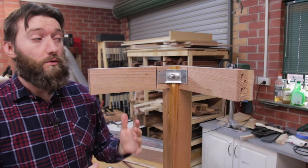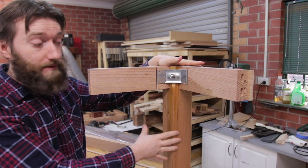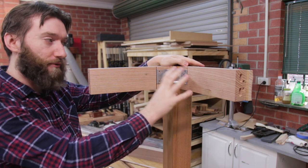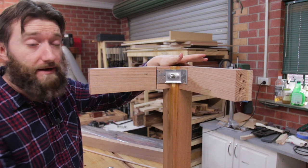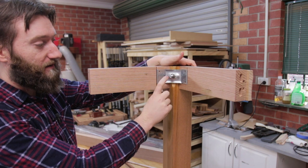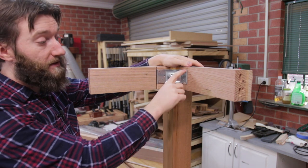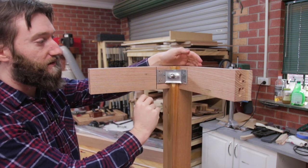This is a mock-up of the leg. I've got two mock-up rails but this is my actual table leg. I'd highly recommend having some excess mock-up stock for the purpose of getting these kerfs right because it can be a little bit tricky. We've got two aprons — these can be permanently or semi-permanently attached to these brackets — a hanger bolt that goes into the leg, and a nut that locks it all down.